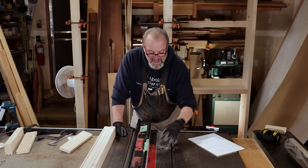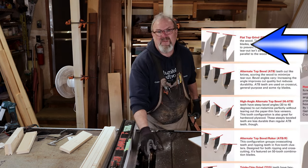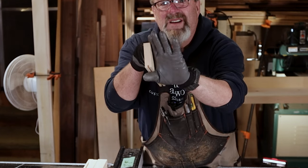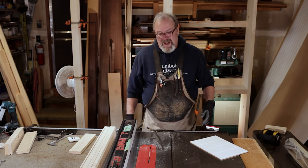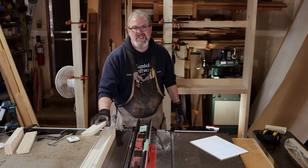And another tip, if you can, get yourself a milling blade. Like this one's square, 1/8-inch Freud rip blade. It's completely square and it makes perfectly square cuts at the very end. You see that? See how square that is? Perfectly square. It's great for dadoing, because setting up a dado stack on a SawStop is stupid. You just do this, it's faster. 2 minutes and you're done. Boop! 2 doors, 2 minutes.